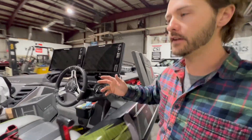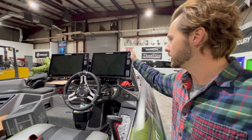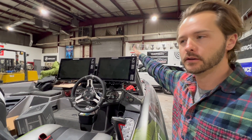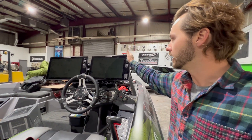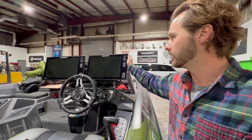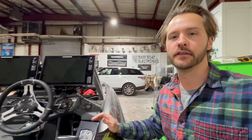You can do it right or left — I generally always set up the right unit since I'm right-handed. But since it was closer to where the customer fished, we made the left unit primary, line-of-sight-wise. Same thing at the console: the external antenna is plugged up to it along with all your transducers, and the other unit is power and network only. Everything pulls off of it.